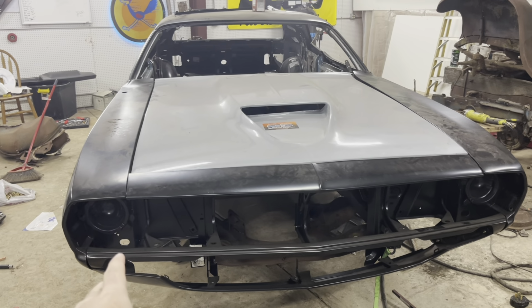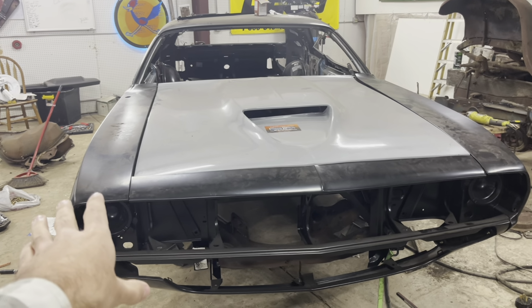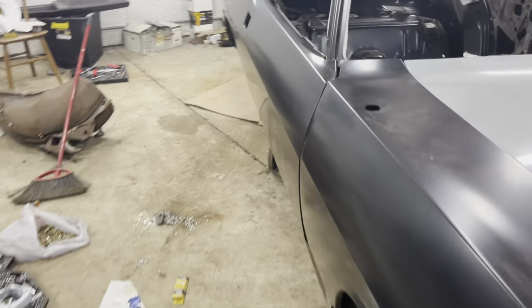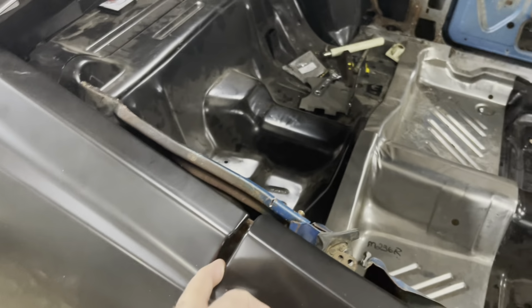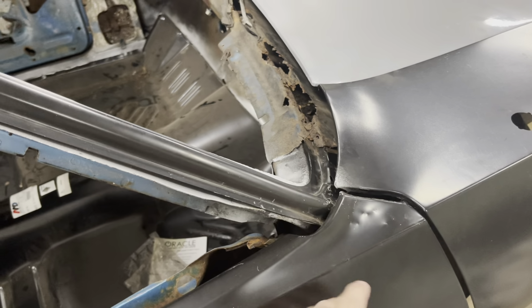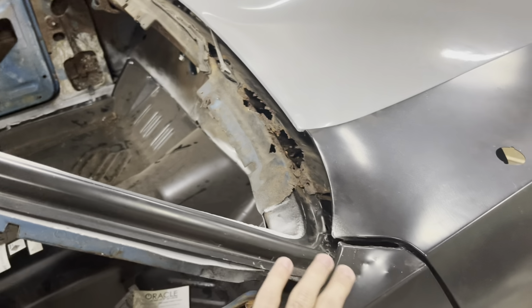Weld the inner fenders and stuff in, then we'll put it all back on one more time, hopefully just one more time. And after we do that, that should be the last time we have to put it together. It's easier to adjust the doors without the fenders on, because we have this gap here, and same way on the other side, and this door's not setting high enough. I made them marks in it when I was messing with that. We'll fix that though, and we're gonna get the A-pillars all lined up, all this welded, that in there welded.